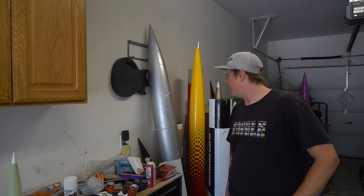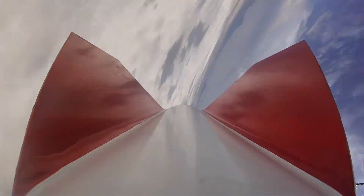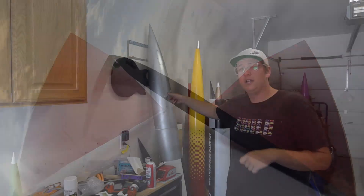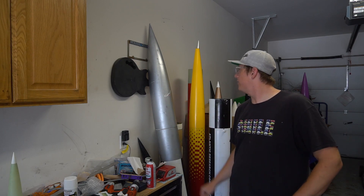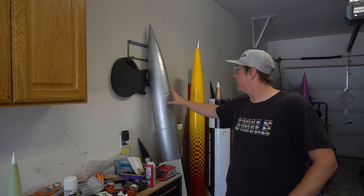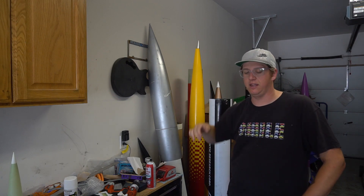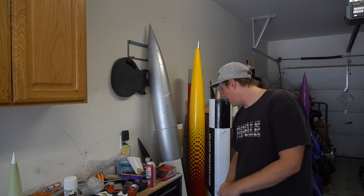That's the first thing that's going to be repaired. The drogue came out, and you can actually see on the onboard footage that the drogue was a little too small — these giant fins create so much drag that the fin can was lifting up above the nose cone of the upper section. Then when the shock cord tugged it, it would line up, streamline, and start coming down past the nose cone, and on one of those passes the fin can hit the nose cone. There's actually a hole in my seven-and-a-half-inch gel coat nose cone.